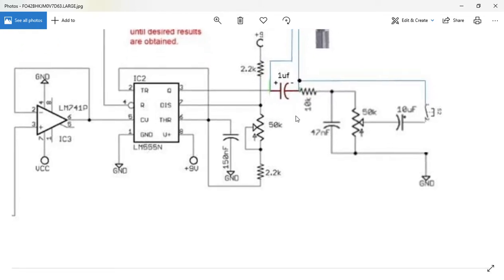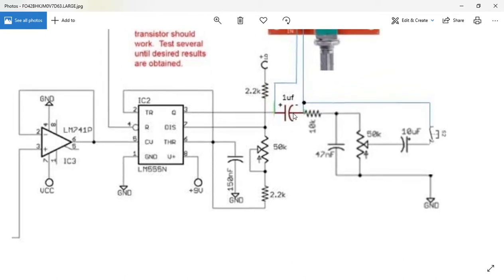But what makes it sound really lovely is this here. We've got a button, a 10 µF capacitor, a 50K potentiometer, and a 47 nanofarad polarised capacitor — connected down to ground. What this does is normally it'll come through and work its way through the 47 nanofarad. This will filter some of the higher or lower frequencies — it's one of them. Essentially this is a filter which then gets bypassed. This bypasses the filter, making it lots louder and also changing the sound, because a 10 µF capacitor, being much larger, will let through a wider variety of sounds — only very low frequencies won't get through, whilst moderately low frequencies won't get through that.